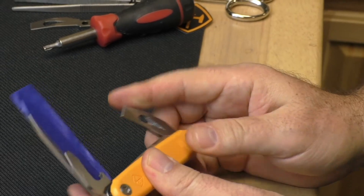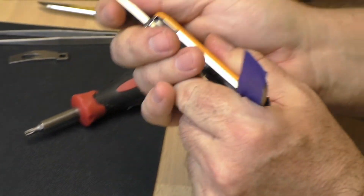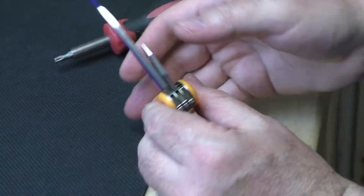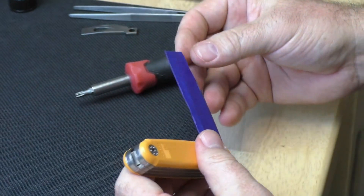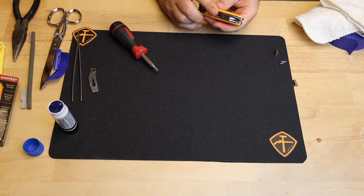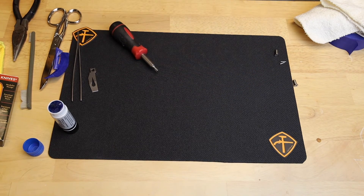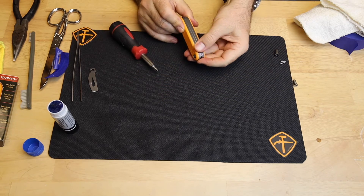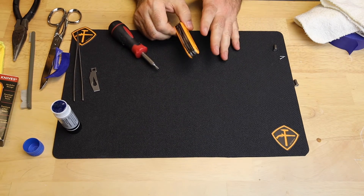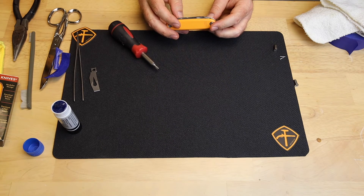Let's see how this one sounds. That's awful, right? So we've got to loosen that a little, and then once you loosen it you've got to open it up, side-load it to make some space, and see how it sounds now — that sounds perfect. I wouldn't mess with it. And we'll close this tool. Then the blade — I pull off like so, grab it back here — and that should slap really clean. And it does. So we've taken our two-layer standard ASK Jefferson. When you hold it up to the light, you'll want to see almost no gaps. You just don't want everything monkey tight — you want it holding together just the right amount. This is why we call it not assembling, but tuning a knife: you want it to sound right, feel right, look right.